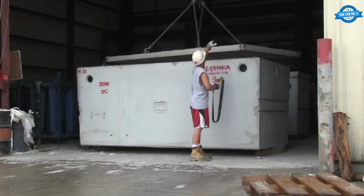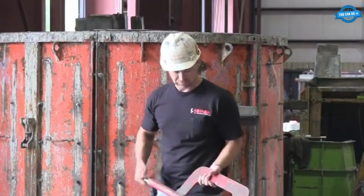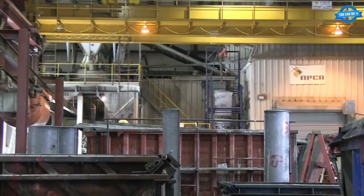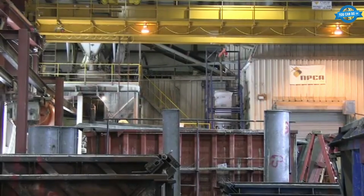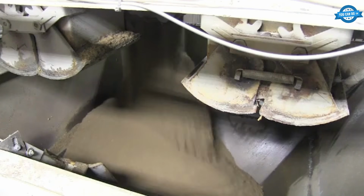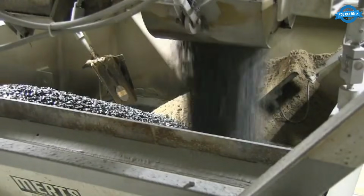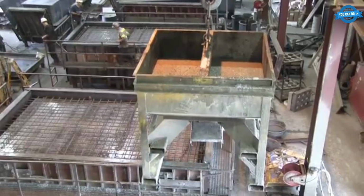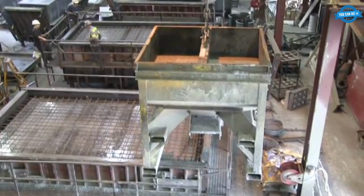Concrete going into a 970-ton span cannot be a mystery mix. Every batch has a target for water, cement, sand, gravel, and admixtures. The control system logs each pour so nothing drifts. Get one batch wrong and you have baked the error into something you cannot exactly send back to the kitchen.